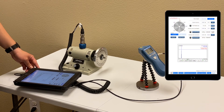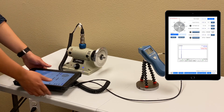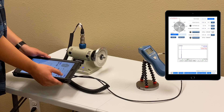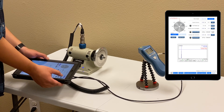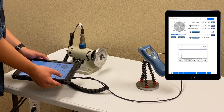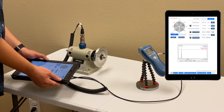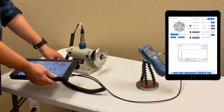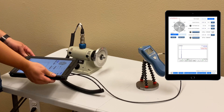In the first round we will take the original vibration. Let me turn on the rotor and press the get button in the app to capture vibration amplitude and phase. It is giving me the number 0.65 at 100 degrees. Make sure you tap the get button multiple times and get consistent readings.